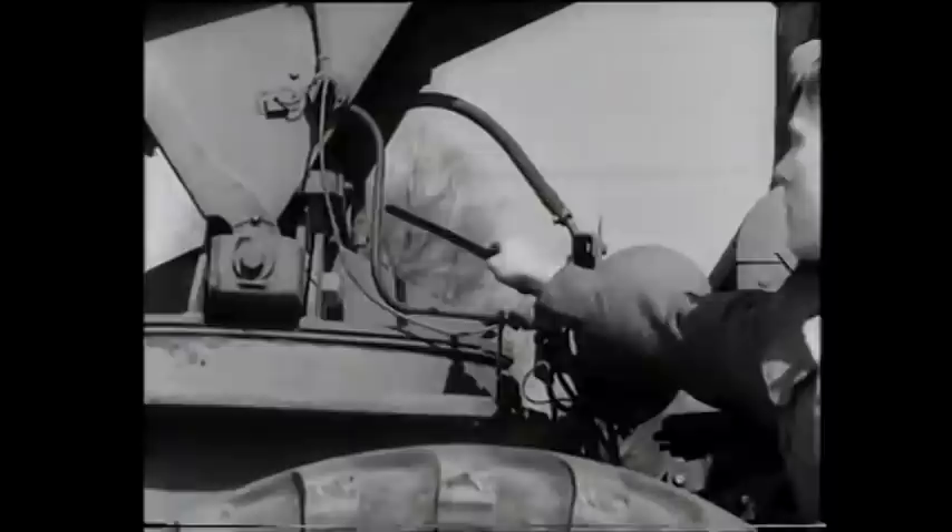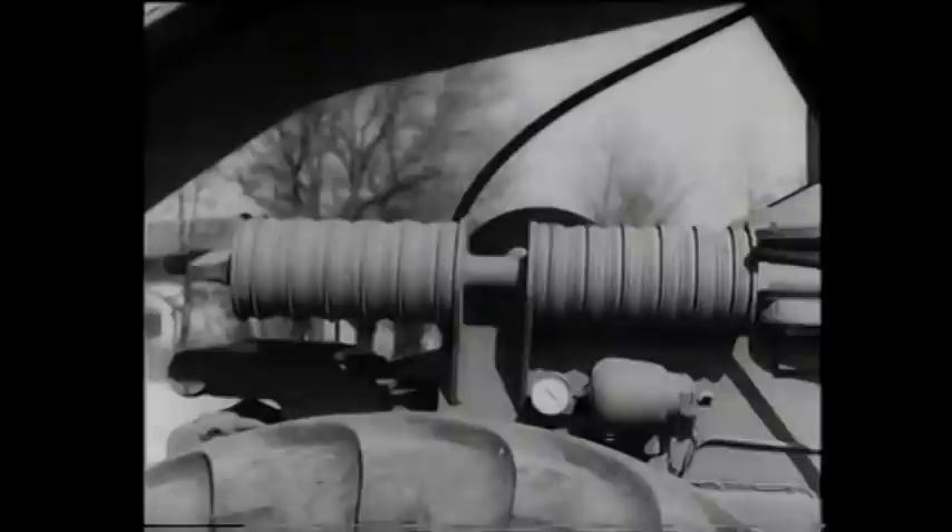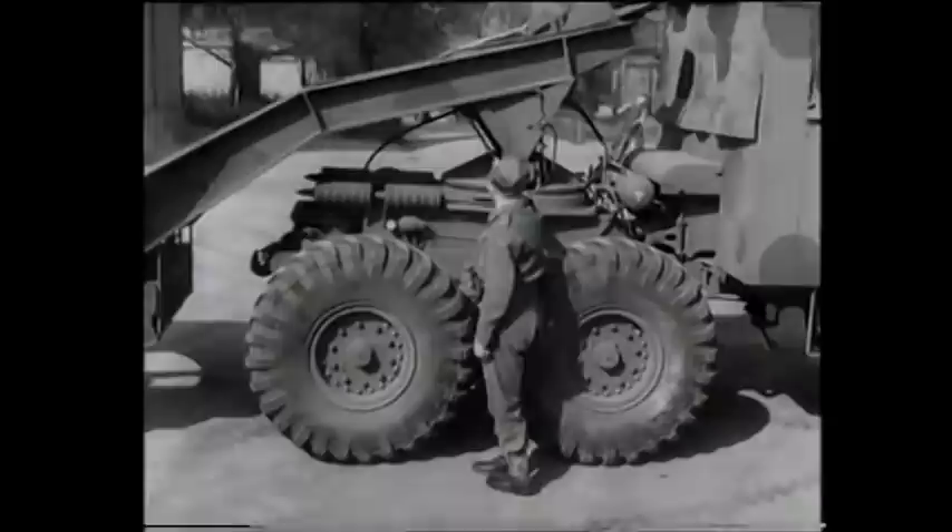These are the trailer air brake connections and the electrical junction. Then the trailer retaining bolts, one on each side. This spring-loaded turntable allows the tractor to make the 90-degree turn you have just seen, while these buffers compensate any lateral shock between tractor and trailer. The path of your winch cable is round this bottom pulley, through rollers, round the centre pulley and up round this top pulley. Here the cable eye is shackled to the side of the frame. When separating or splitting the unit, the platform is supported by this single hydraulic jack, found in a central position at the front end of the platform.